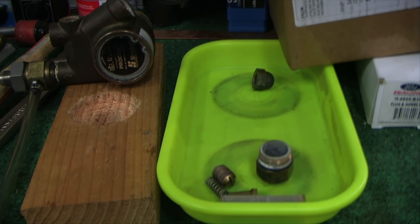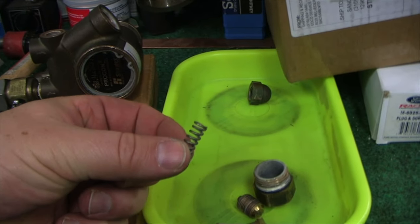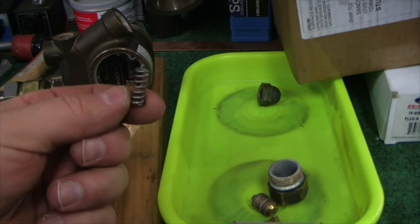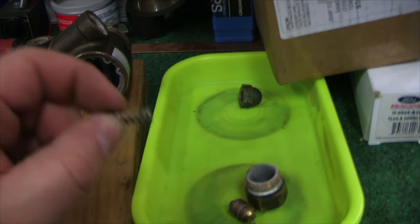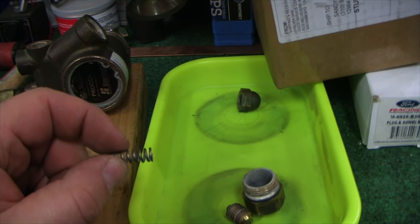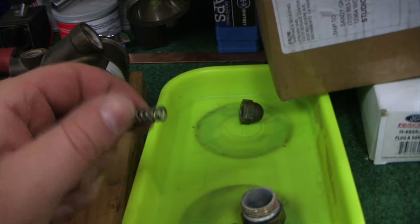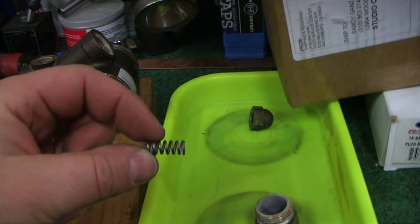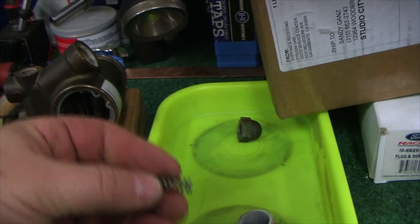If you're doing this for a TIG pump rebuild, the spring is set for 250 PSI. You'll want to change it out or loosen it up as much as you can practically — I would not rely on this to regulate your TIG flow pressure. For a carbonator or coffee system, the stock spring will work fine.